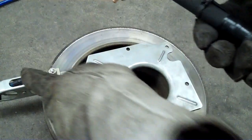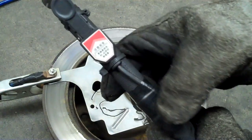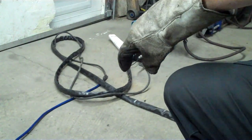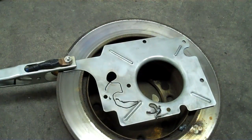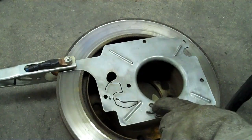So inside of here you've got the negative cable — this is negative and that's positive — this is basically your ground. The air hose has the cable inside of it going up into here, and this is just a switch that runs inside this sleeve. When you look at the machine, the connection that's blue right there is the connection for the negative, and then out of the sleeve comes the trigger switch. I got it all put back together and then it wouldn't cut at all — it wouldn't arc, it wouldn't spark, it wouldn't do anything. So I had to unplug it from the wall, and after plugging it back in after having it unplugged for a minute, it decided to get happy, and that's where this cut came from.